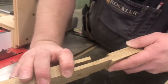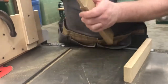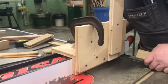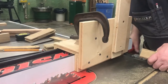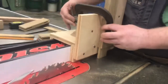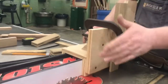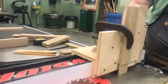Here I go — I'm still creeping up on that. As I look and do this comparison, I can see I still have about a sixteenth of an inch to remove. Once I get this first piece set and I like it, I'll cut them all without moving the saw blade. I'll cut them all at that setting and then go back and trim out the rest from that one.